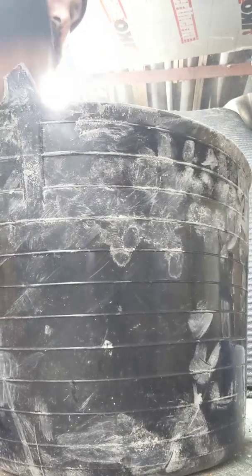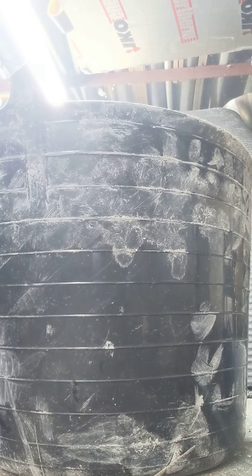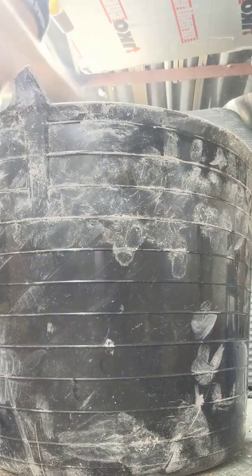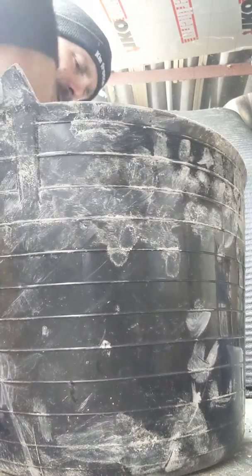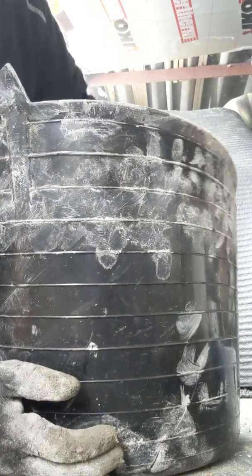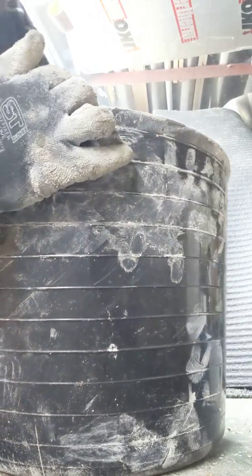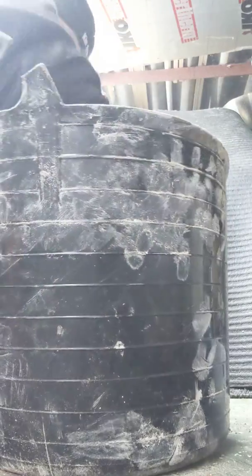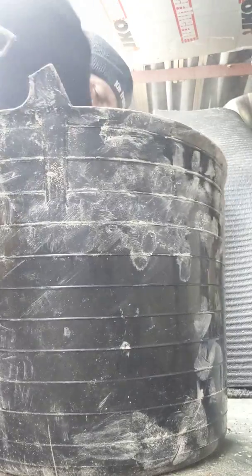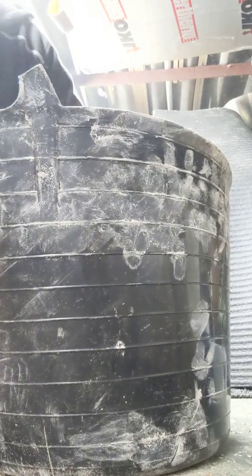The perlite supposedly holds a lot of the water. When I've actually made all these segments, the first 4 I baked in the oven once they'd set over a couple of days, and I noticed a lot of steam come out of them when I opened the oven. What I'm going to do is leave them for quite a long time and bake the next 4 as well, just to get as much moisture out as I possibly can, because moisture in blocks does not go well with it. Again, somebody might correct me on that. I'll have to say it's an experiment. If it works, well, hey, if it doesn't, we'll go back.